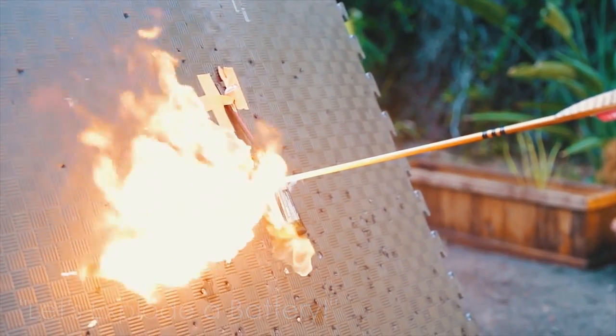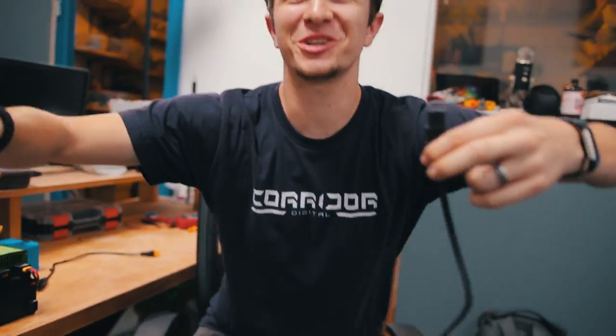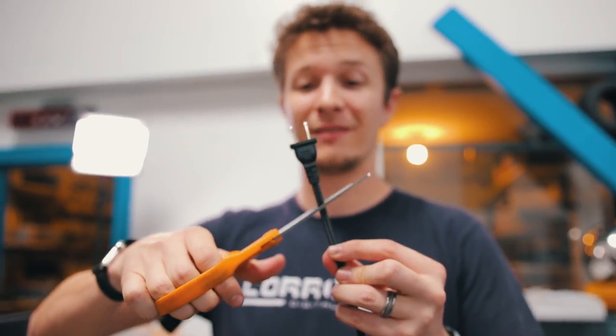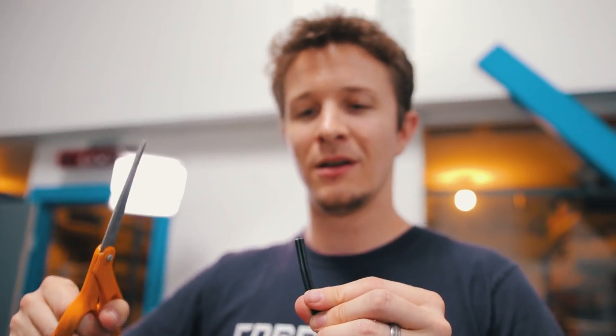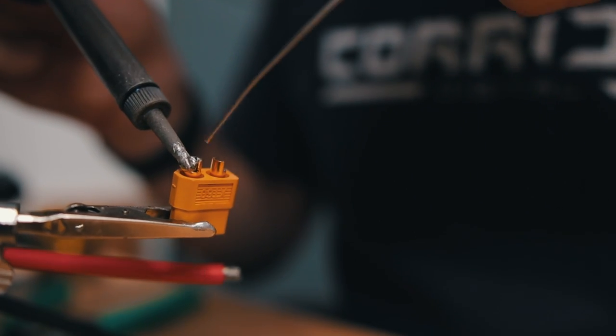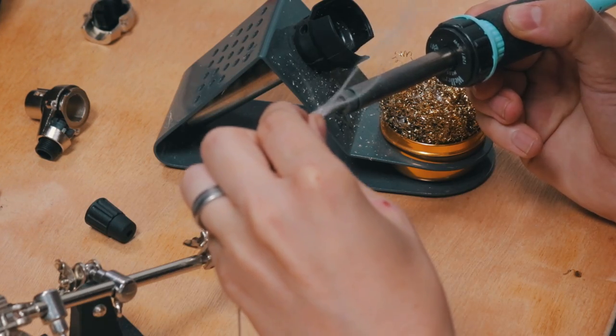For this mod there are two main things we're going to adjust: disconnect that third pin inside the plug, and extend the length of the cable using a classic laptop cable. I'm going to cut the tip off — there's something about cutting electrical cords with scissors that just feels so wrong. I only need the two wires in this cable: one's a negative, one's a positive terminal, and I'm going to solder some XT60 connectors to the ends. The second part is a very specific 90-degree angle XLR port, so that in the event you crash or spill, it won't roll over and break the port. I'm going to rip out one of the pins and solder the two wires to the other two pins. In theory, this should work. I'm decent at soldering now. I am worried about potentially ruining the Onewheel if this is running — but only a little bit worried.